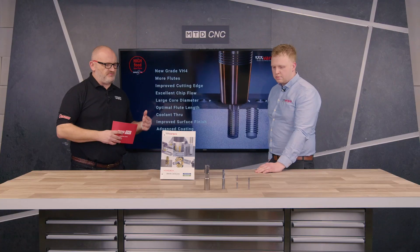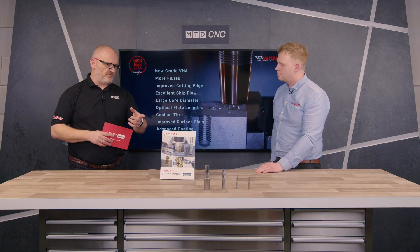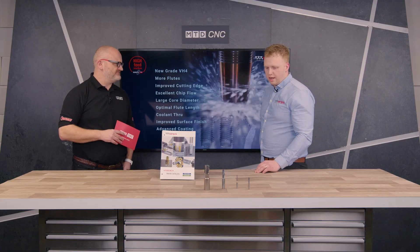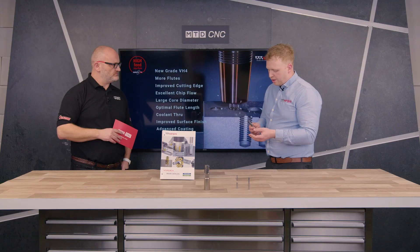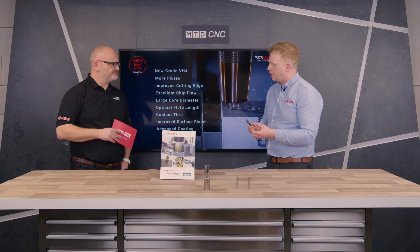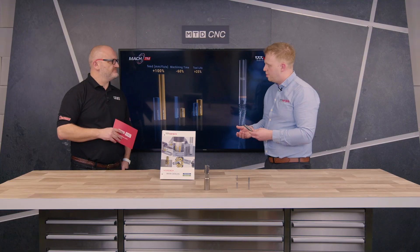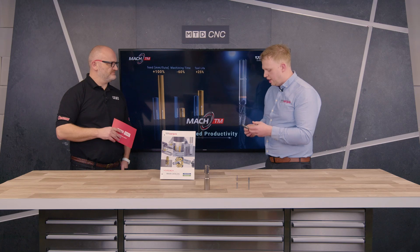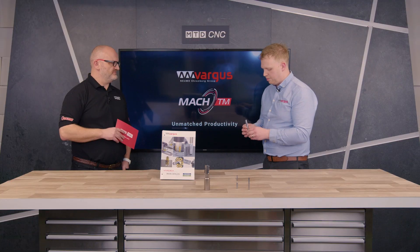The MAC is obviously a product we've featured a lot on this channel. It's a five-flute deep-core tool. Essentially it's an improved version of what was already being offered — it's got a larger core diameter, an extra flute, and it can feed incredibly quickly. In some instances it can be a lot quicker than tapping. It's got an improved edge prep, and the coating and substrate are unique to this product — a very robust, versatile, and fast thread mill.